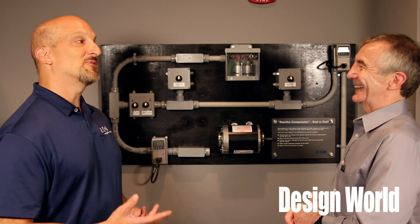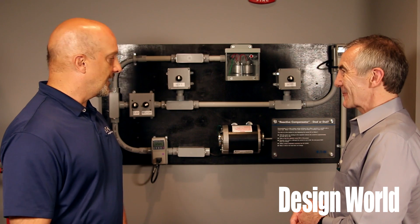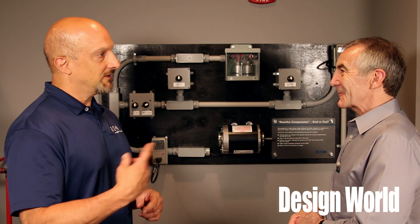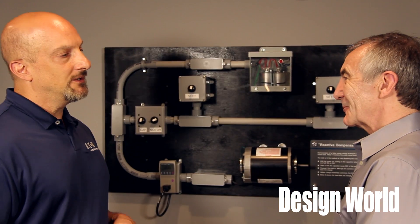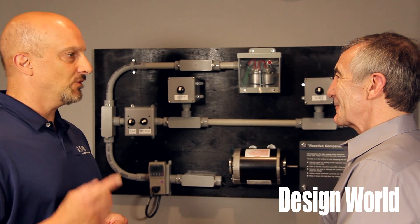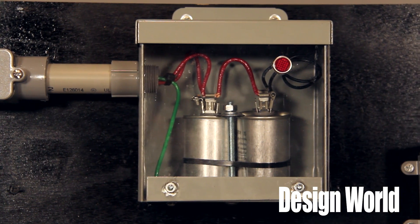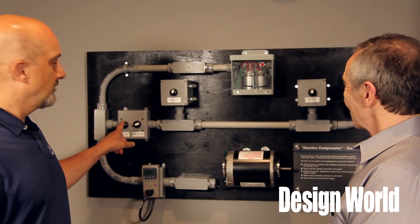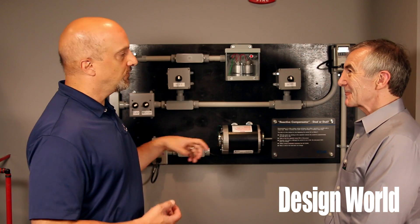Well, it doesn't, but the way that it's promoted is like this. This motor is a typical half horsepower motor that would be in maybe an appliance in your home, and it's not loaded right now. What a motor needs to run is reactive power to make the motor spin — basically it gives it the magnetic field — and it needs real kilowatts. When I turn on this capacitor, it draws reactive power equal and opposite to the motor. We call that power factor correction. It counteracts the magnetic field power required and compensates for it from the utility side.